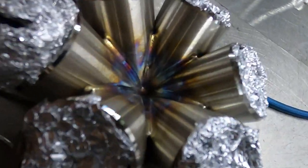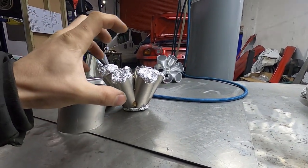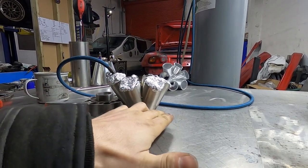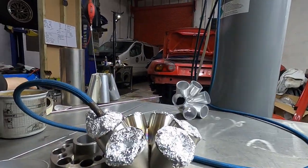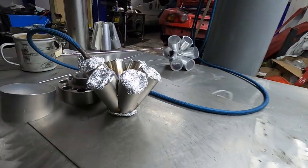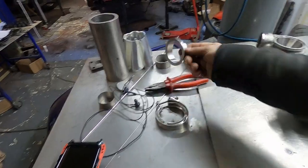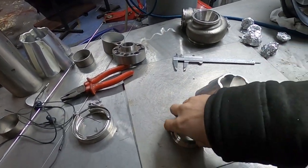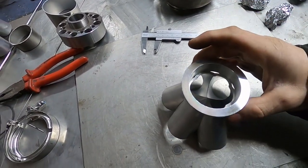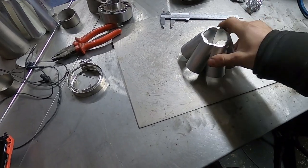Let's see if the camera picks everything up — it won't focus, shame. Once we've done the weld, you have to weld that face because everything is going to pull once it's welded and settle down. We have to chop it on the bottom to match the v-band flange — this diameter here, the inside. The merge collector has to match the v-band right, and pretty much the inside diameter because this is where the flow goes.